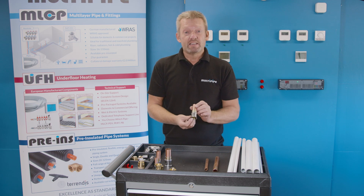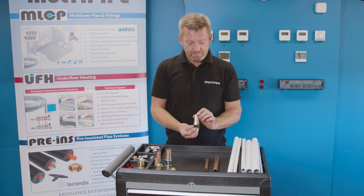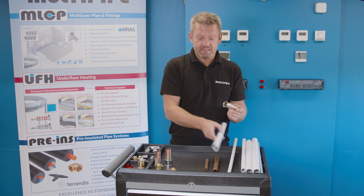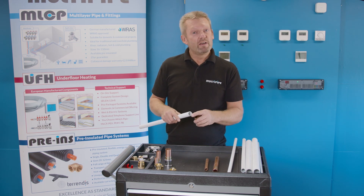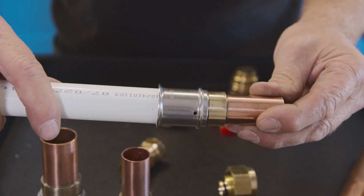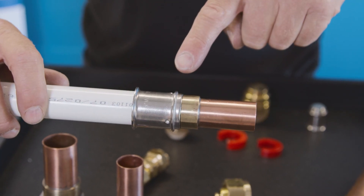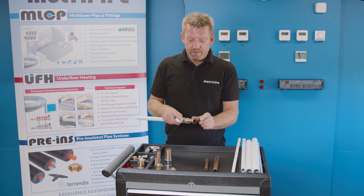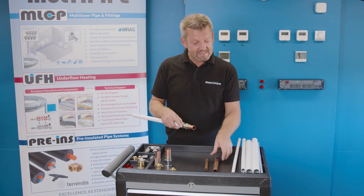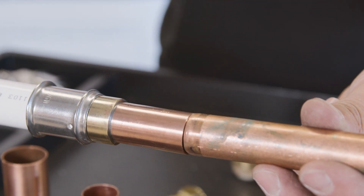With this 25mm to 22mm pressed copper tail, you would prepare the pipe exactly the same — cut and bevel the pipe, then slide the press adapter onto the MLCP fitting and press that with your traditional pressing gun and pressing tool. That leaves you with a 22mm copper stub, exactly the same size as your standard 22mm copper pipe you'll find throughout a property.